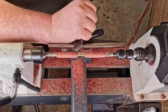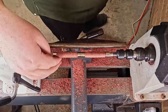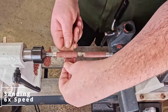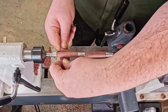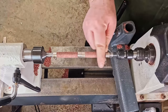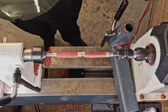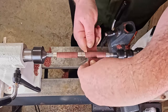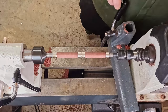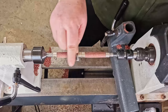You may notice that I'm rubbing my fingers across the end of the bushings and the wood. What I'm doing there is using my nails to see if it catches or if it's sitting beautifully flush or just below it. I'm doing my standard 150 through to 600 grit — I let the lathe do the turning which gets some circular motions, then I hand-turn it and do left to right along the grain, which takes any of those circular motions out.